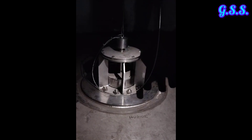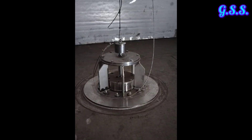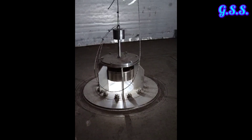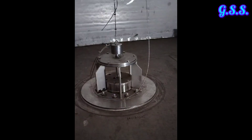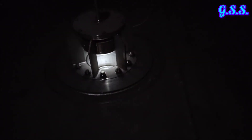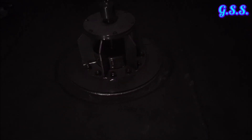Now you can see how this quick shutoff valve is tested from inside the tank using light from the tank bottom. If there is no light passing through the valve then the valve is okay. There is no light passing — the valve is confirmed okay.